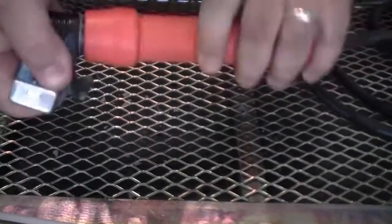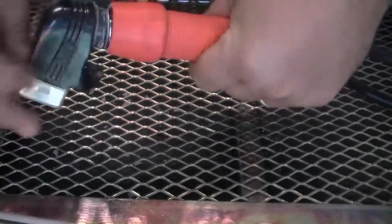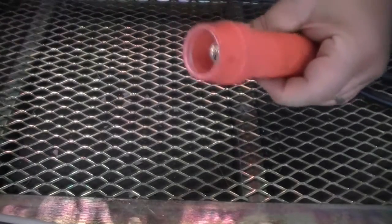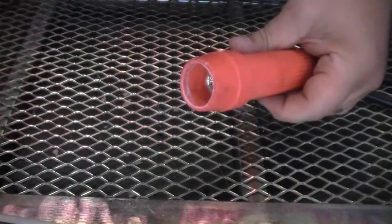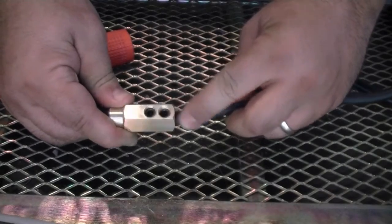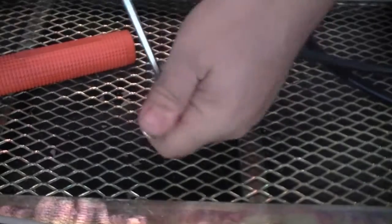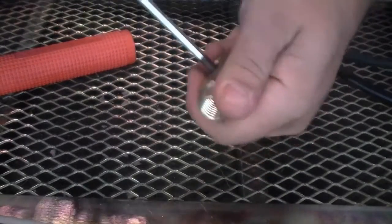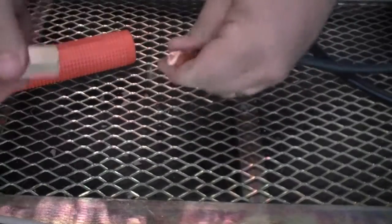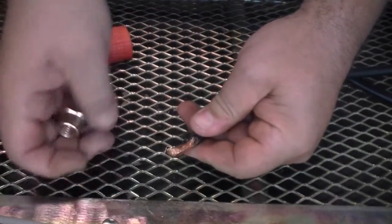To replace the stub type holder, unscrew the head completely. This will expose the tension spring and locating pin. Remove them and pull the handle off the metal body. You'll find two locking screws under the cover holding the cable in. Take a hex key wrench and loosen them so the cable slides out. This cable should also have a metal shim when you pull it out.